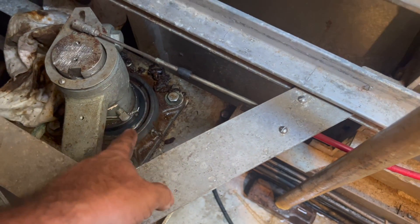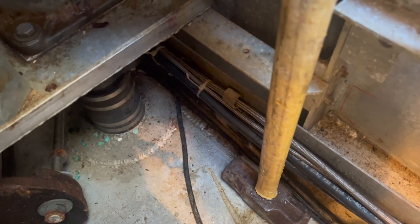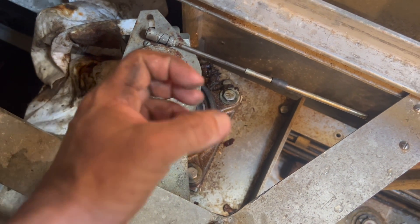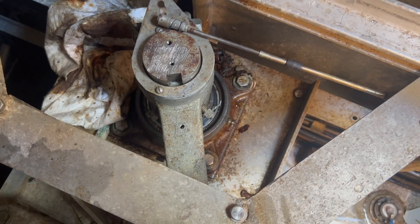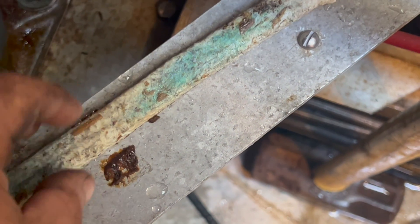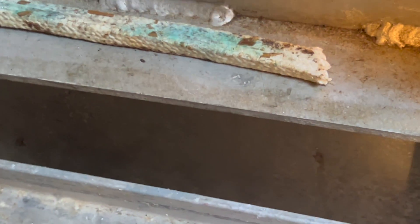I don't know if it's inside the bearing or down in the sleeve. There's a rubber hose and four clamps, and then this big shaft right here is actually the rudder — it goes all the way down, attached to the rudder, and goes through another aluminum collar. Your packing is right there. You have a lower collar and an upper collar, and in between those is packing. Here's what the packing looks like — it's like a beeswax material, squishy but very hard to squish.